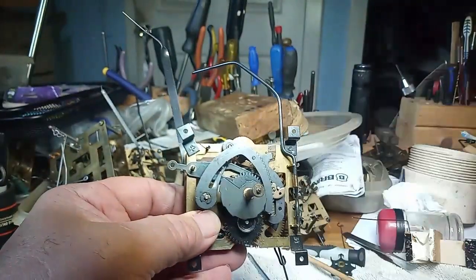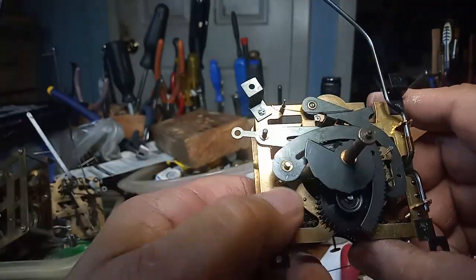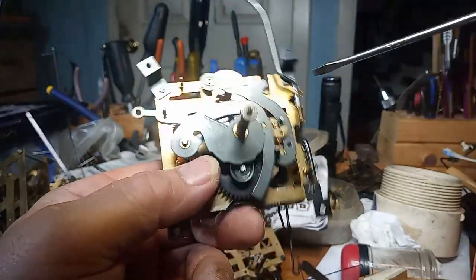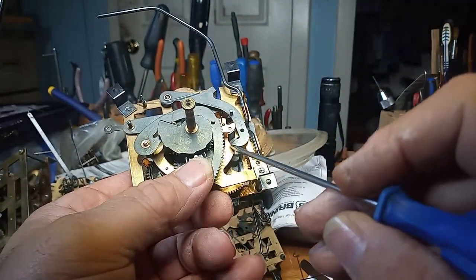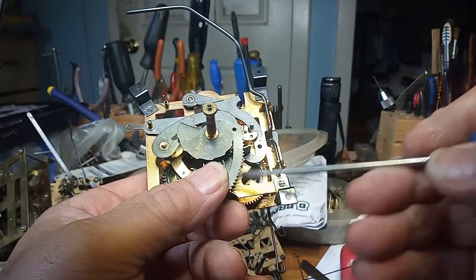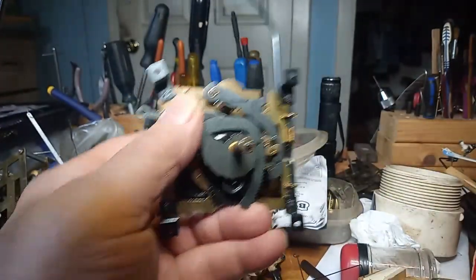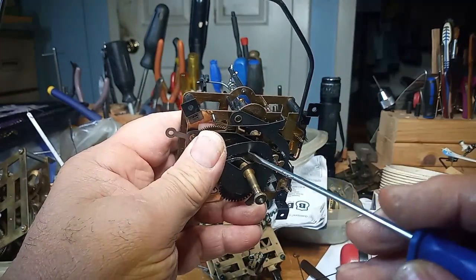Now I have to fix this. So again, if your clock is striking 13, as I talked about before, this lever needs to go into one of these notches. If your clock is striking 13, try bending this tab